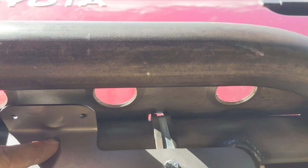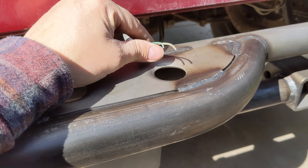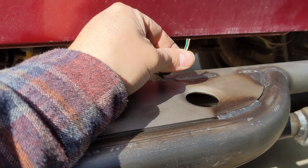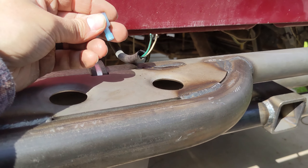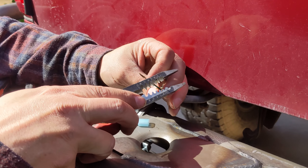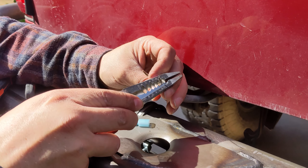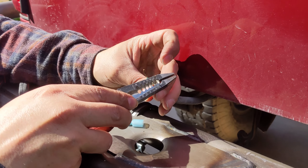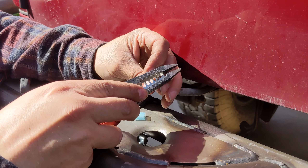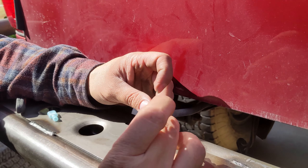The two holes are going to hold up the LED, and this is where you pass the wire through. We have a male and female quick disconnect. We've cut off the original lamp and we're going to strip the wire back about a quarter of an inch, then put the connector on and crimp it so we can remove it at any time. Because this is stranded wire — about 20 gauge — the fit is tight. From my experience, you bite it on the correct size, then go to the next size up, and it strips off much easier.